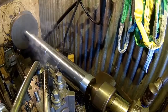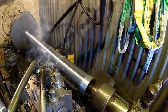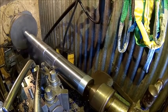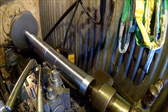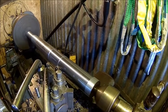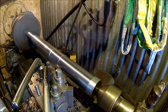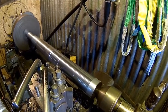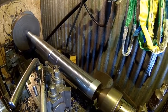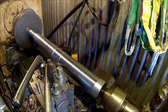The WNMG from yesterday lasted — it's still okay and I did a lot of turning on it, so we'll see how it does. The chip breaker works sometimes, depends a bit on the speed. If you go higher in speed the chip breaker doesn't work anymore — it's still using massive, lengthy, springy chips. But at the moment it's okay, let's carry on.